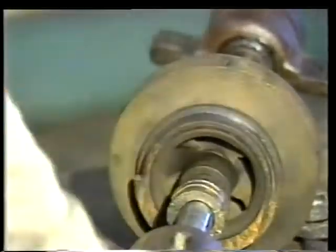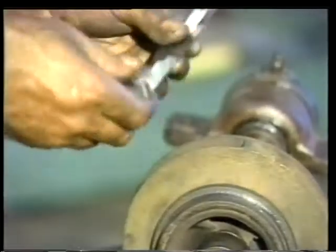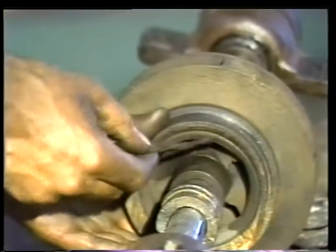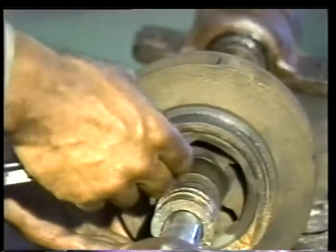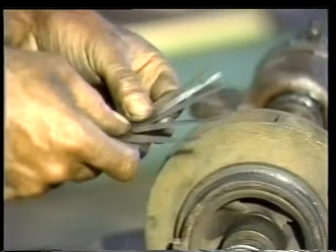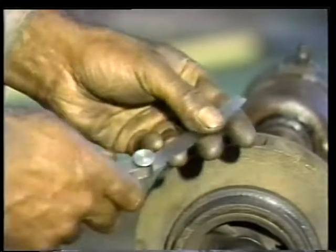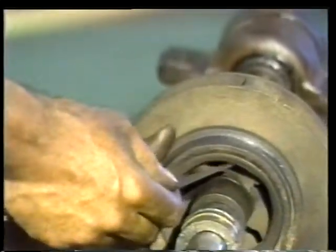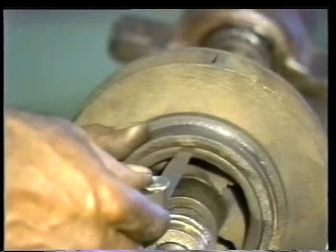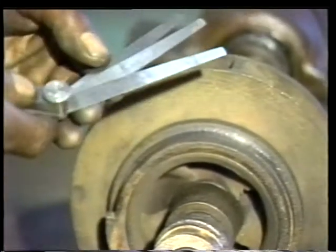When you finish inspecting the shaft, make a preliminary check of the casing wearing ring clearance. With the ring in place against the impeller, insert a feeler gauge into the space between them. It usually takes a couple of tries to get a combination of blades to fit snugly into the gap. Also, notice how much this casing wearing ring shifts up and down whenever the mechanic touches it. This is a pretty sure sign that the gap is too wide. In any case, compare the measurement you take with the recommended clearance in the manufacturer's instruction manual.